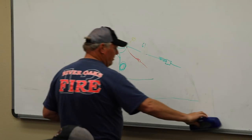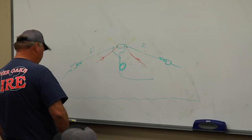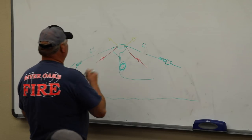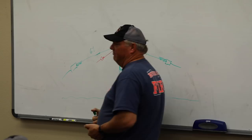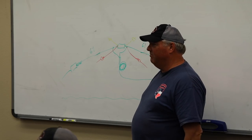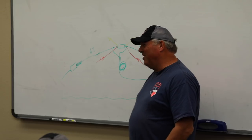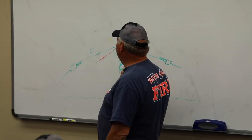You have to think about the turns you have to put on it. It's about 13 microhenries. There's a guy that's got a website that'll calculate that whole thing out for you. It tells you the size of the PVC pipe, how many turns, what the wire size is, whether it's insulated or not. Bruce and I did it the hard way. No, that's the way to do it.